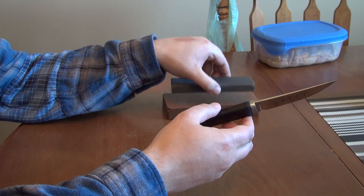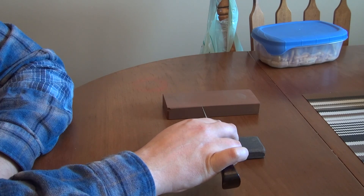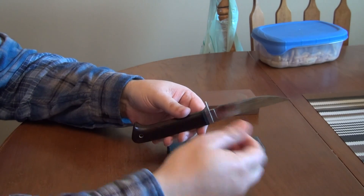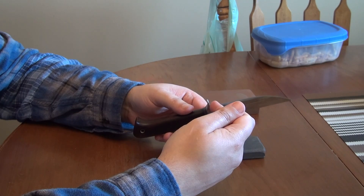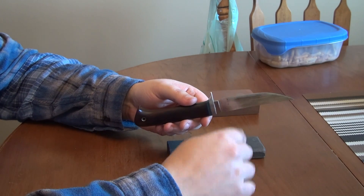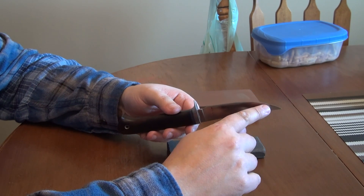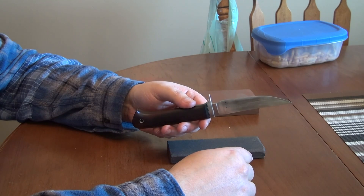So the basic procedure, which I have outlined before, is basically take the knife and slice it directly across the stone to de-stress the edge. That does two things: number one, it grinds away all the weakened, bent, and chipped metal. And the other thing, it keeps the edge relatively flat or with the existing curvature — it stops any hollow points or recurves from setting into the edge.